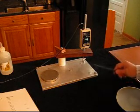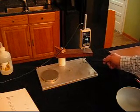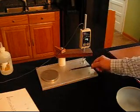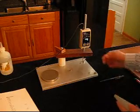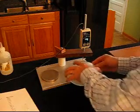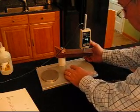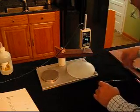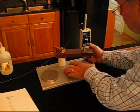The next important thing is to measure wedge. Here's my very simple wedge gauge I put together. I have two large nuts that I hot-melted down and three small ones that my part — lens, mirror, or whatever — will lay on. What we're going to do is measure the height out on the edge. I carefully set this on the three small ones, bump it up against the large ones, and take measurements around the edge, looking for the high spot and the low spot.